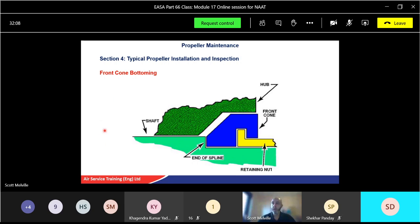So back here, you'll have the assembly, and behind that, you'll have the rear cone, which we've adjusted to match the assembly. And then by pushing or putting shims or washers behind the back cone, that'll push everything forward, which will take up this gap here. Okay. So for adjusting the rear cone, we actually physically sand it down a little bit.